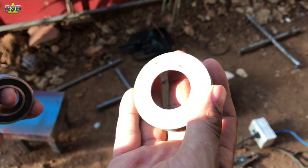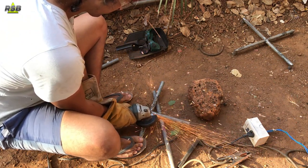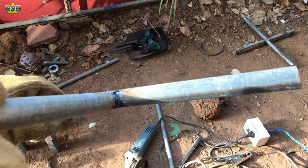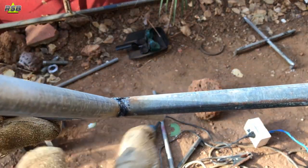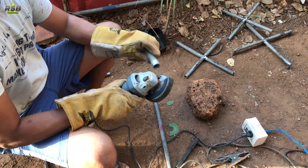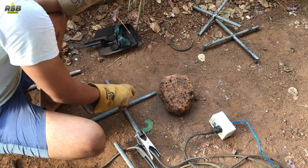The top part of my table which I have already welded — I will grind it a little bit where I welded and make that spot flat. Once you make it flat, you can see how flat it has become. The rod which will be going on top — I will also grind that a little bit so that it becomes easy to weld. This pipe I will join on the top part of my table.